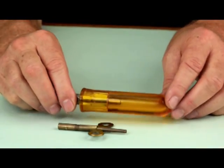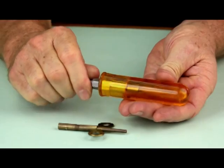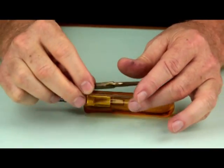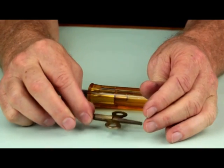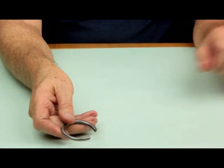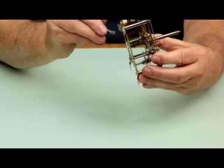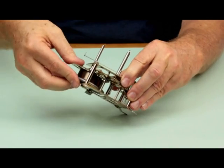This is a letdown key. Its smooth handle lets it freely rotate in your hand. Never use a regular winding key with finger wings as a letdown key. You could tear the skin off your hands or break a finger. This is a mainspring clamp. When we slip it around the mainspring, it will contain the power of the mainspring, making the movement safe to work on.